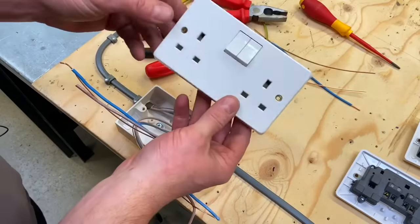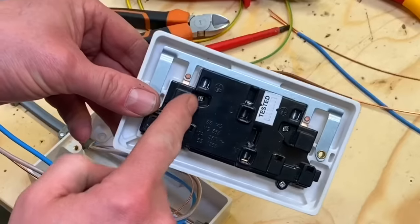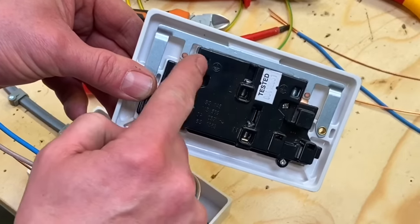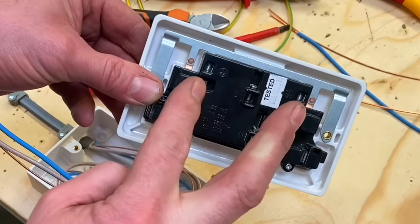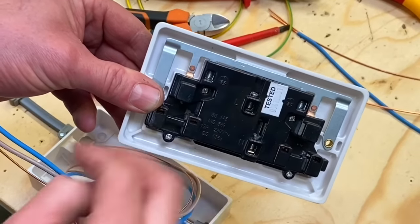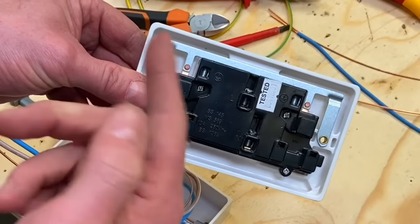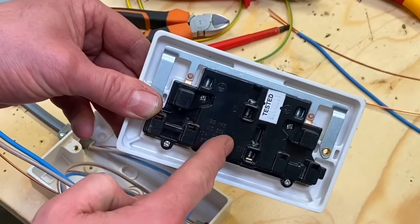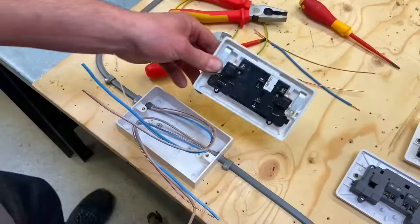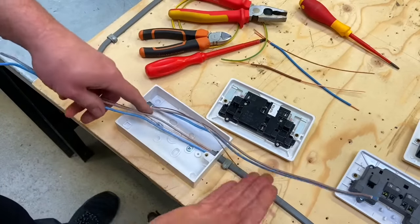So let's bring the camera in nice and close. This is a Crabtree branded socket outlet. Looking in the back, we've got two earthing terminals with the earth symbol, so we've got CPCs to be connected in those two terminals. When there are two terminals I like to put one CPC connection in each. Then we've got line and neutral — we're going to double those terminations over, working out how deep the doubling needs to be so we don't see any copper.